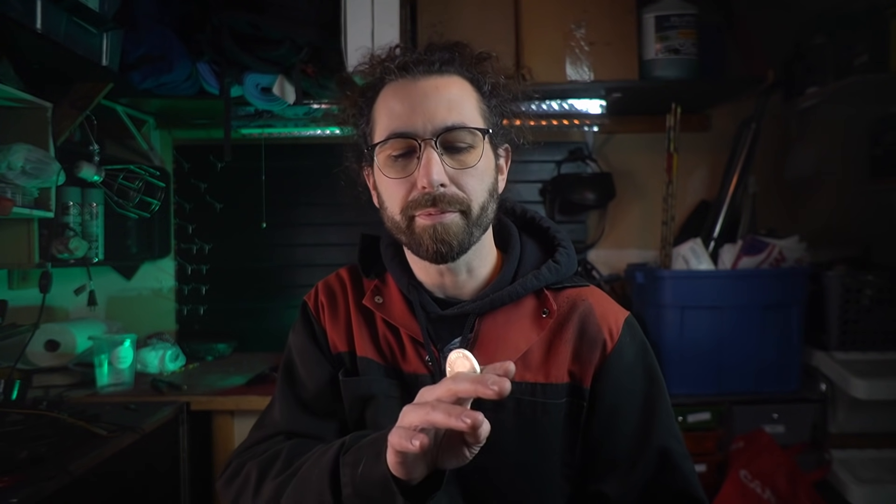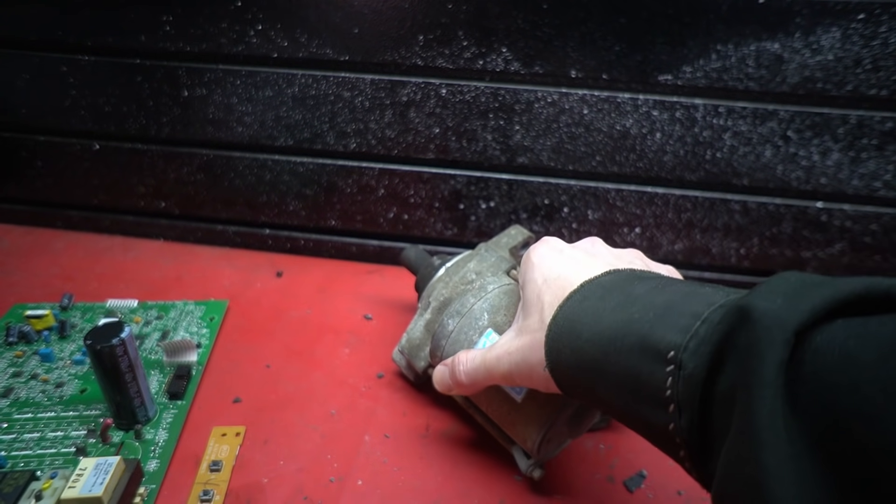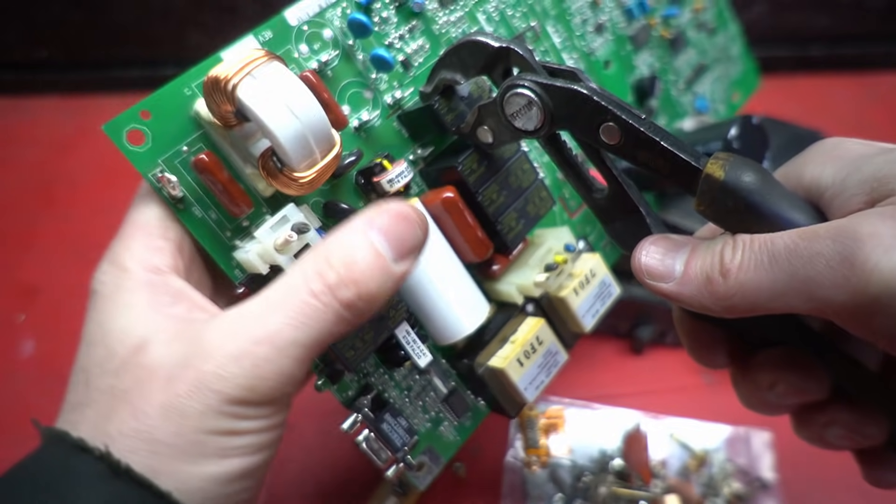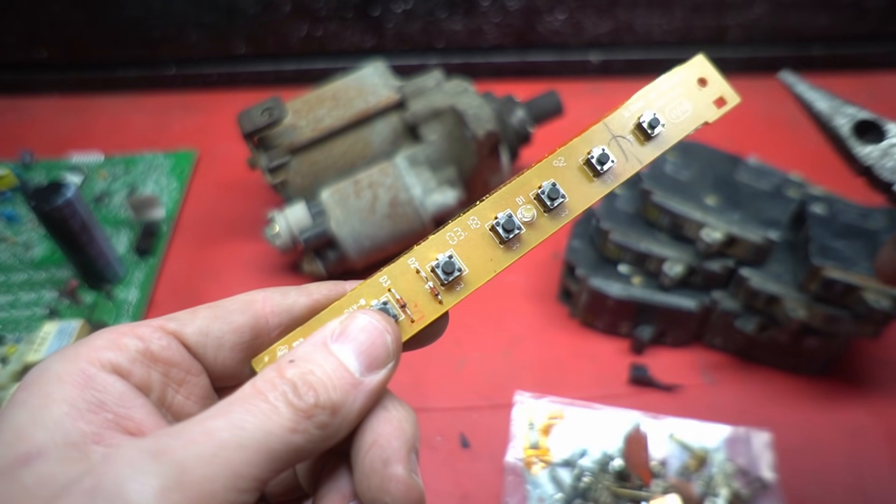So let's talk about where. Now we're here for the scrappers, so obviously you can find old coins, jewelry, spoons, and those sorts of things which are silver. And while I do think I can help identify those, that's not where we're going to focus. Scraped silver will be in high conductivity places. Things like connectors and the ends of ribbon cables can be silver plated if they're not gold. Keyboards like this one have a silver mylar inside. A lot of brushes and starter motors will be silver graphite or have silver armatures in them. I've read that plasma screens have a layer of silver oxide coating, but I couldn't find a lot of information to support that, so I'm not sure. But those are very small volume and you'd need mountains of the stuff and great big vats of acid to recover any real quantity — they aren't economical. What you'll want to find are silver contacts: the little buttons that sit as points of contact in places where electrical currents are switched on and off. These are in electrical relays like the kinds on a circuit board or in a car, electrical switches of all kinds, and in breaker boxes.